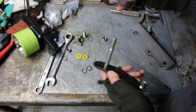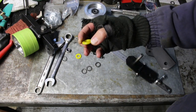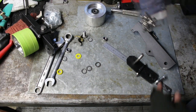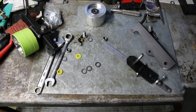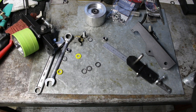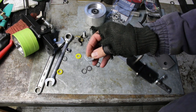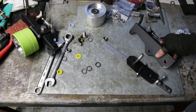You do need to space it. I will note that on some of my other wheels I've used nylon or teflon spacers. One wheel I machined — I don't machine them anymore, I get them made because my machining's not the best. One wheel got a little bit hot and the teflon melted into the bearing and ruined it. So what I use now is galvanised washers — 3mm thick — and they can handle the heat or anything else that goes on. I don't have any trouble with my wheels heating up now because I get them professionally made.